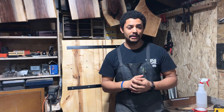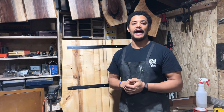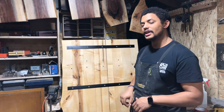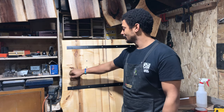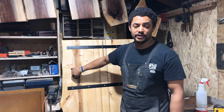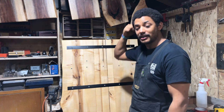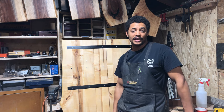The other thing is a lot of table legs — like the classic X-frame metal legs I have custom fabricated by a guy in Mississauga who does amazing work — all the holes are just drilled in, and that can also cause issues. As we can see, the threaded inserts actually got ripped out and skewed. If it weren't for just the C-channel here, I'm sure the damage would have been worse. So look for metal legs with slotted inserts, especially if they're expanding across the width, and I'm going to see if he can fabricate them that way from now on.